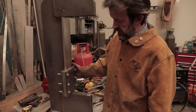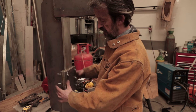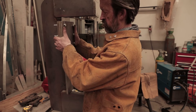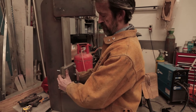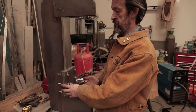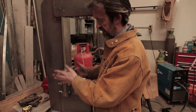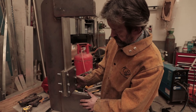That's all bolted together and drilled. I've used nyloc nuts on the back which gives me a little bit of adjustment if needed. At the moment it's fairly snug at the top, but I'll leave it for now because once I get grease on it and it has the weight of the bottom arm and springs, with 20 ton pushing it up it's going to be fine. These ends are a little bit uneven but they can come off later — I can true them up. It doesn't need doing but just to look right. That part's finished.